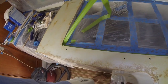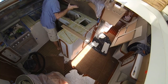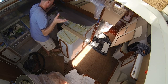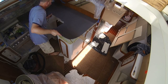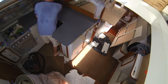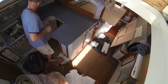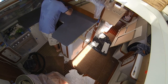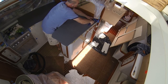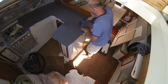Once you've got one or two layers of contact cement on, I'm going to lay my laminate down. I want to make sure that I get my edges perfectly lined up. If you don't have them perfectly lined up and you put it down, you're not going to get it back off in one piece. So you want to be very critical at this point. I use dowels — and I stuck a little piece of wood in there too because I ran out of dowels — underneath it, just to put down the sections little by little.